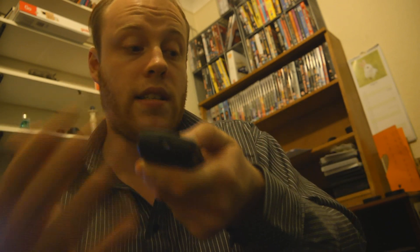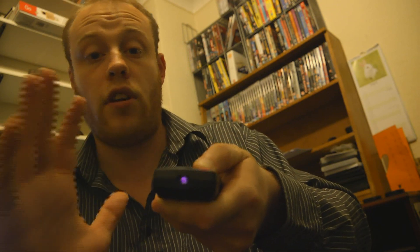if it picks it up like this, you can see the infrared light coming through and you know that your camera can pick up infrared light. Now, just to show you that this is definitely infrared light and I'm not just tricking you, this is an infrared filter like so. That's going over the lens and you can see there that the infrared filter is blocking out everything apart from the IR light coming from the controller.